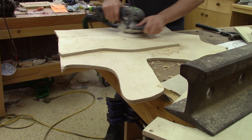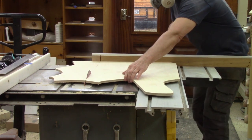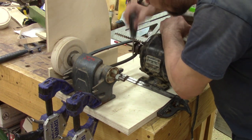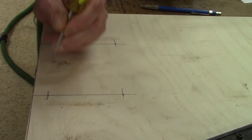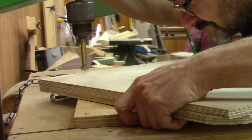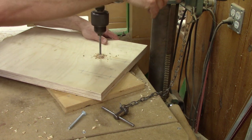While the glue dries, I can take care of the base. Now that I have a nice square base, I can figure out where to put the motor, then the grinder. Now I can drill the holes for the carriage bolts — I begin with a small one. Then I turn the base upside down and with a Forstner bit, drill a hole for the carriage bolt heads, using the small holes as guides. I turn this again and drill the bolt holes.